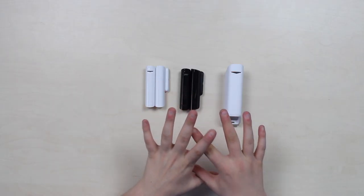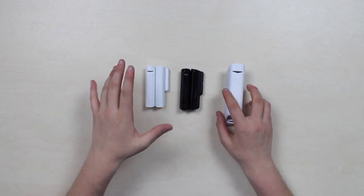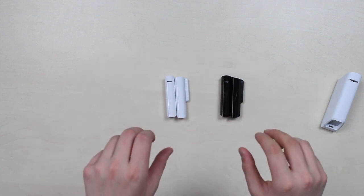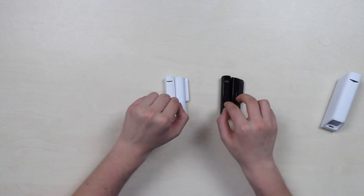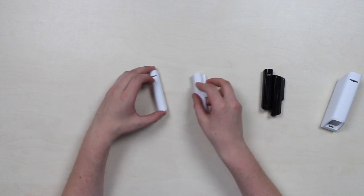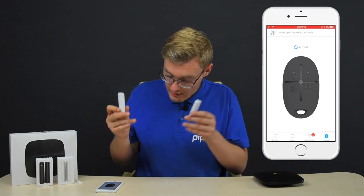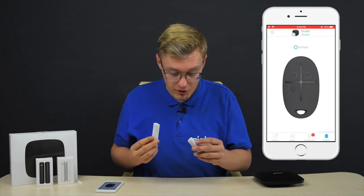What's left is the Curtain and Door Protect sensors. The Door Protect is a reed switch that detects when contacts are closed or open using a magnetic field principle — a combination of magnets and a reed switch, essentially a 1 and 0: closed and open position. Here's a live demo: we disjunct the contacts and immediately get a notification that the door is open. The two additional panels are just magnets — one for door installation and one for window installation.